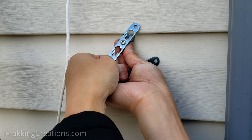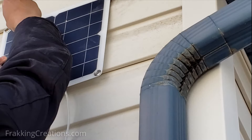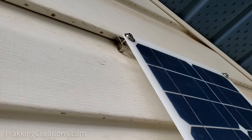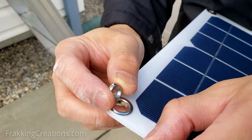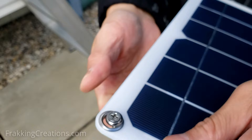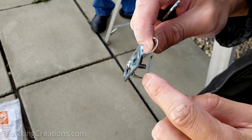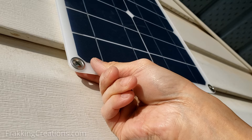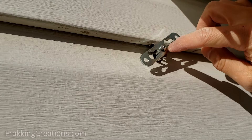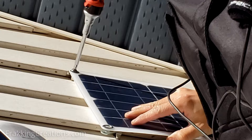Note that the keyhole brackets are zinc plated to better withstand the weather. First, attach the solar panel loosely to the top two hangers. Note that the grommets on this particular solar panel are larger and will not work with most screws, so use some stainless steel finishing washers that are slightly larger than the panel grommets and also fit the screws you are using. Attach the keyhole brackets to the vinyl siding hangers using screws, and keep them slightly loose. Then insert the bottom hangers into the siding. Next, position one end of the bracket to line up with the lower solar panel grommets. Once the positions are lined up, tighten the screws on the keyhole bracket to secure in place. Then tighten the top vinyl hanger screws, making sure to center the finishing washer.